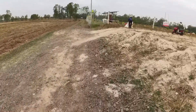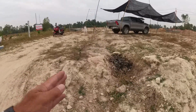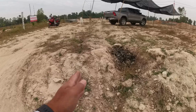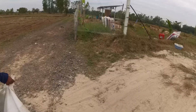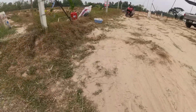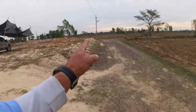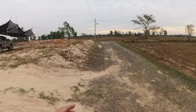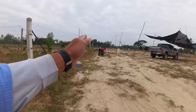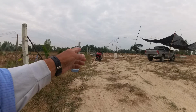And we'll have a back gate right here. That gate will be approximately right in here somewhere, I think. The post will be at 4 meters wide. We will get to about right here, straight off that post, straight down to that little stick. I probably can't see it in the camera, but in the camera it looks like it's about a foot off that post, but back this way. From here, straight past the motorbike through those concrete beams, 2.5 meters off that other wall.